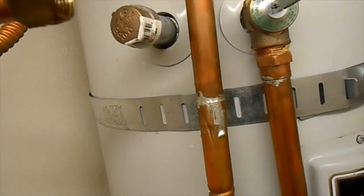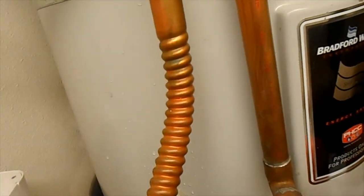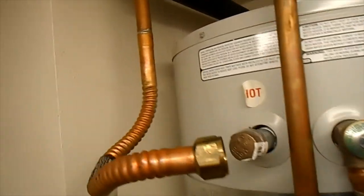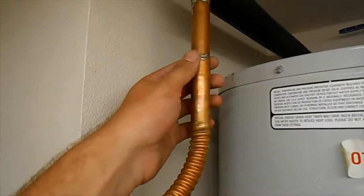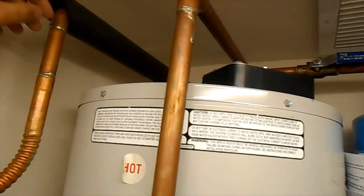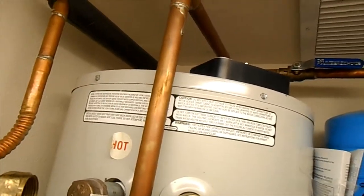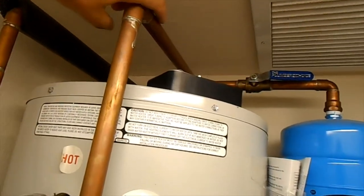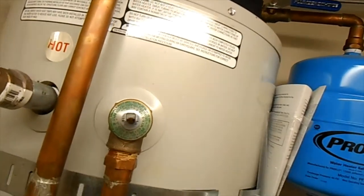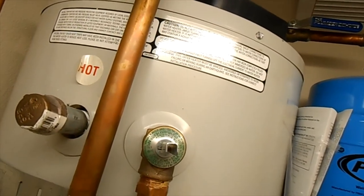This is my mom's building. We don't have the new water heater in front of us today — we were going to replace it, but somebody didn't get it ordered or whatever. So we're just going to cut the soldered-on flex right here and here so they can pull the heater out today. I've got my piece on here so she can just easily put flex on there.